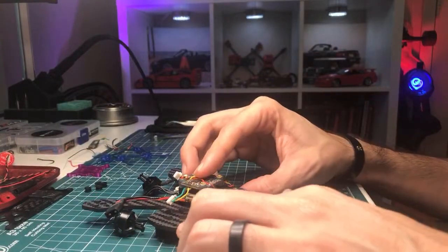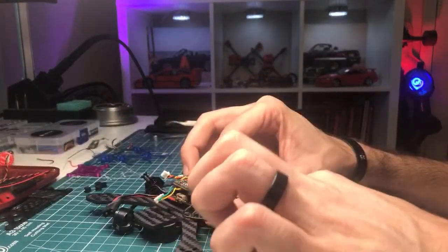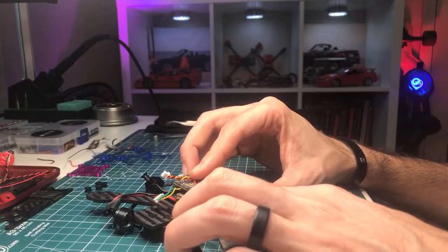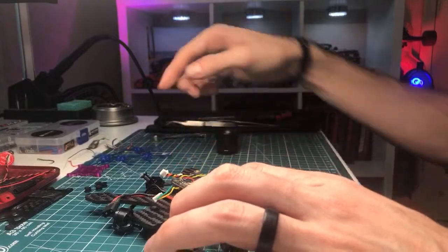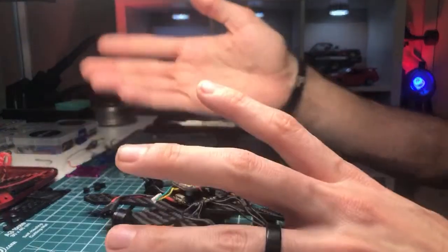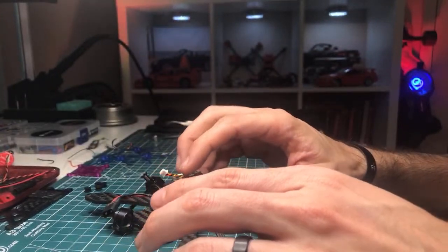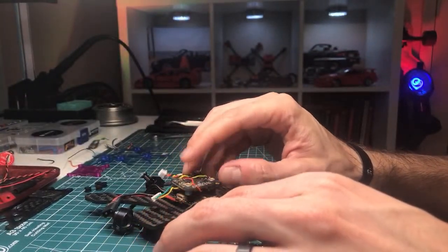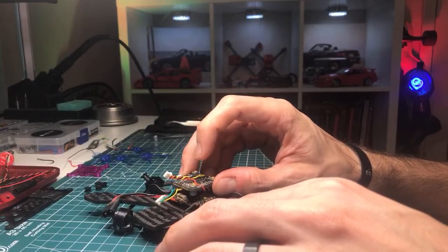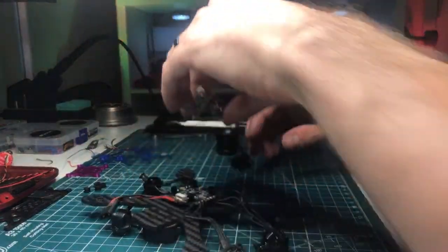So think about that, right? We've got a 20 mil standoff. Now we've got a 13 mil stack. That leaves us 7 extra millimeters for the thickness of the battery strap. Never forget about the thickness of the battery strap. Whatever, you guys have seen a battery strap before. Thickness of the battery strap and someday an HD board. So yes, that's what I'm gonna do.